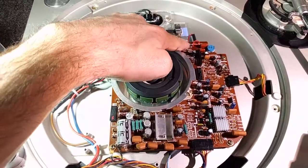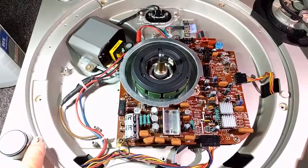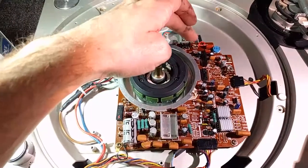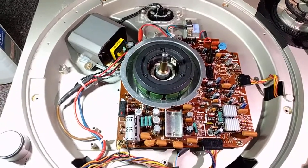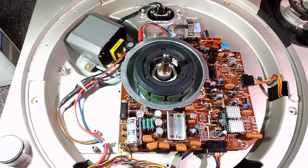Added a 1-kilo-ohm resistor, took out the 120-ohm, and what that does is it lowers the brightness of the strobe light. How the strobe light works: it gets 21 volts from that resistor, and then the other side gets 17 volts, so it's actually 4 volts total. A little bit confusing when you see 21 volts going to LEDs.